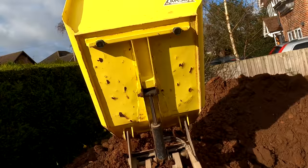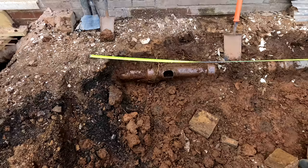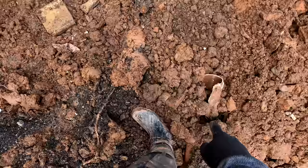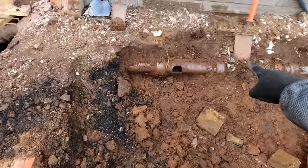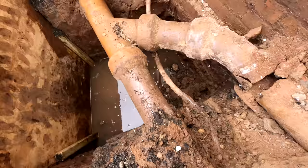What we've got here is our soil pipe running through. We already knew it was running through there, and now as we've been scraping this oversight away, we've exposed it here. There was a knuckle on there - we've got a big hole in what is the soil pipe. So we're going to have a chat with the client, make sure they don't use the toilet, and then we'll put a new temporary piece of pipe in across here just so we can get all this excavation done safely and without any mess.